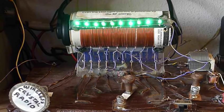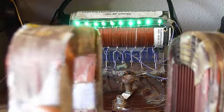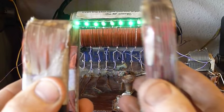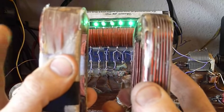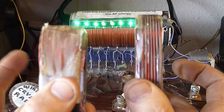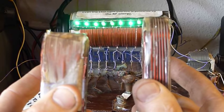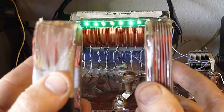I was just thinking about how amazing these crystal radios are — they work much like transformers. For example, if you took two coils, with this as my primary and those as my secondary, just by having alternating current going into this one, you'd end up with power coming out of the other one. What's interesting is that even though this coil isn't physically hooked to that one, as soon as you use power in this coil you can actually measure power being taken out of the other coil if you had an ammeter on it.